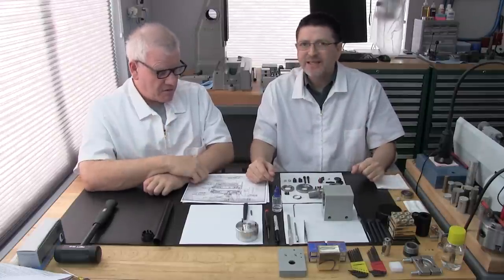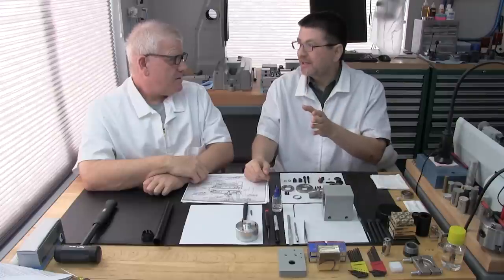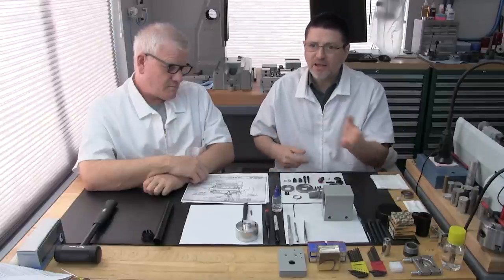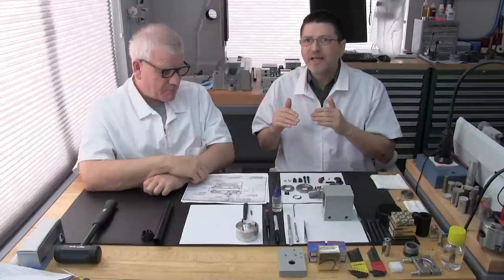Close enough. And that's the worst thing that can happen, to be in the middle of an assembly. Let's say you're in the middle of putting your bearings onto the spindle, and then you realize, oh God, I'm missing a part. I'm missing the bearing spacer or the locking collar. That's a really bad situation because now you're stuck. Your bearings are already greased at that point. You've already started that timer. Your headstock's open, and we don't want that situation.